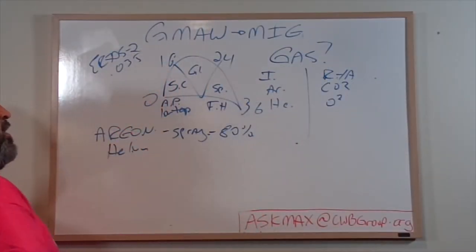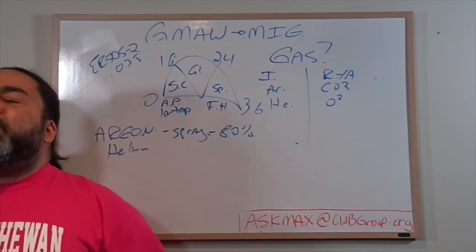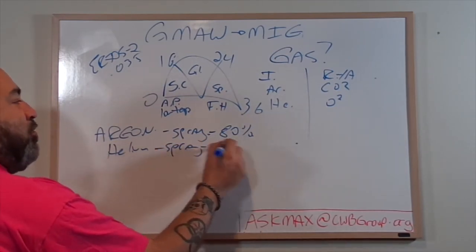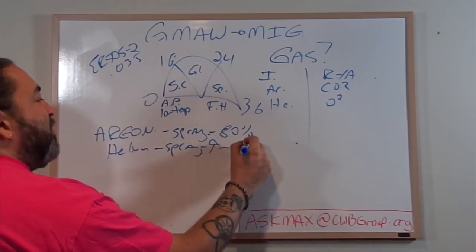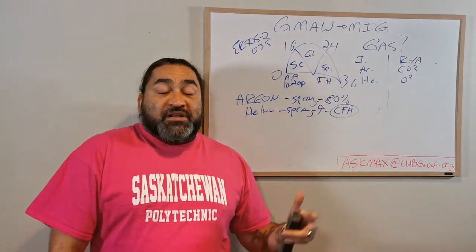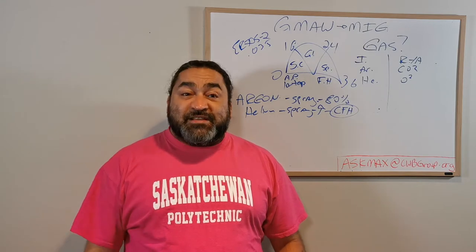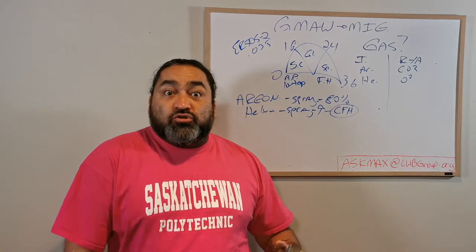Now I go to helium. Now helium is like the little bouncer, a lot of little bouncers. Remember we called them the ninjas. Now they're expensive, and I can use them in spray, no problem. But I'm going to need a high concentration, and I'm going to have to really crank my volume, my CFHs. Which means I'm going to have to be in the 50s, 60s, 70s for CFHs for helium. Which means I'm going to draw a lot, I'm going to use a lot,